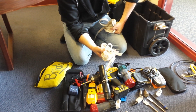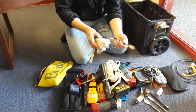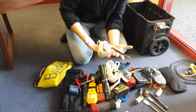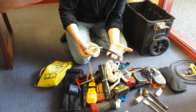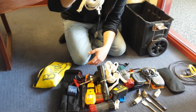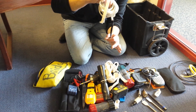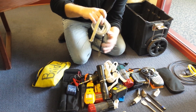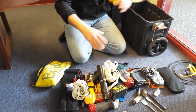This is mule string — great for high tension. I always carry it; it works better than pull string sometimes when you just need something rough. Here's my contraption that has saved me a lot of time: just some mule string about 12 feet long with a weight on it. I can take it right down the wall — if I've got a clear shot I drop it down and I'm through, prep and everything, within just a couple of seconds.